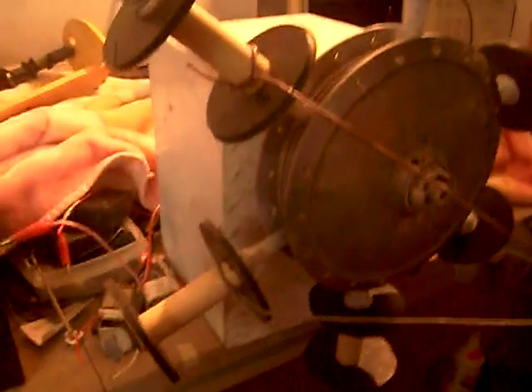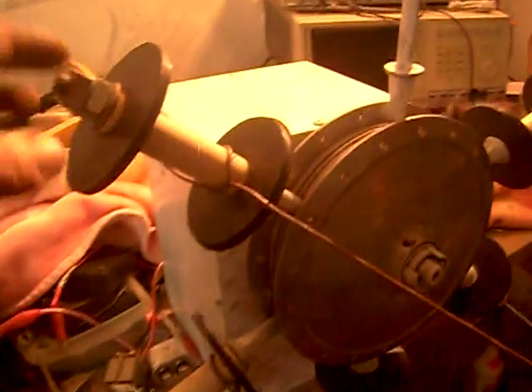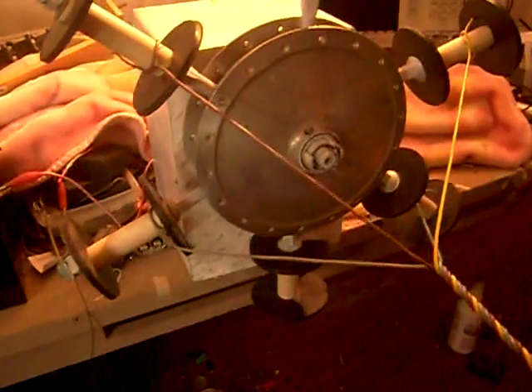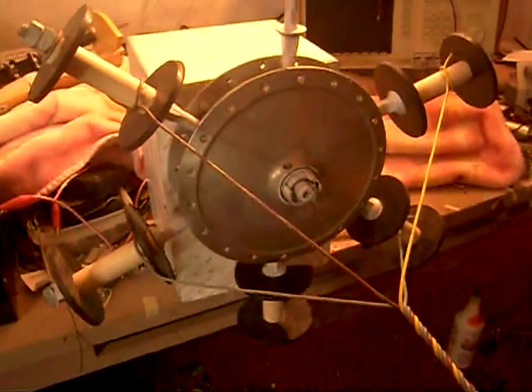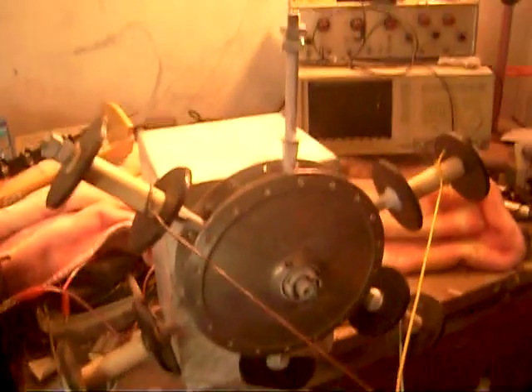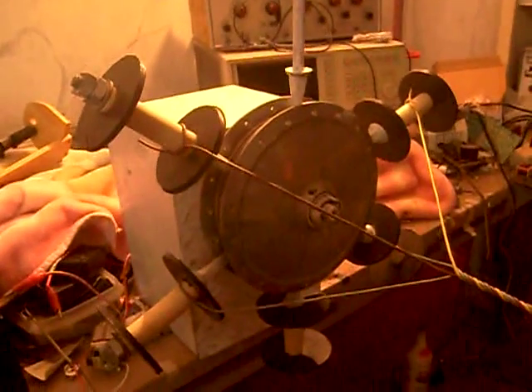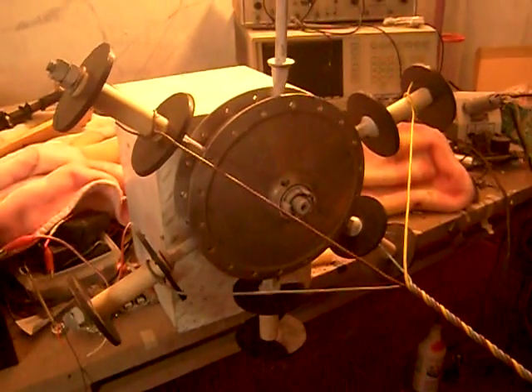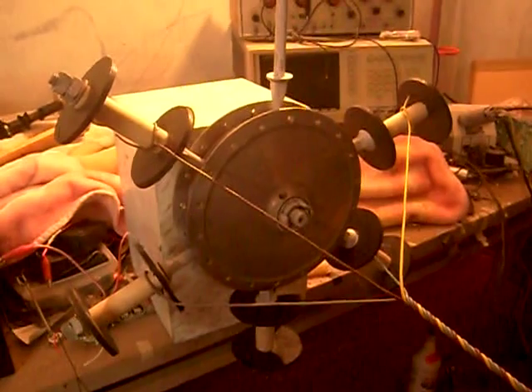I put a motorcycle hub on it, on the shaft coming out the other side. I happen to have this bolt stop here. There's one extra spool because I'm only winding five coils — four power coils and one trigger — so one of the spools is smaller and one is empty, since this machine can do six. That's what I wanted to show you — this is Brother Mikey's Beast Oscillator John Bedini coil winder.